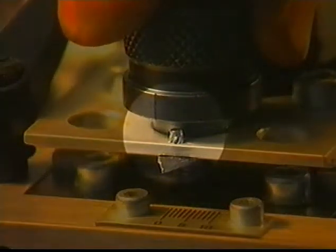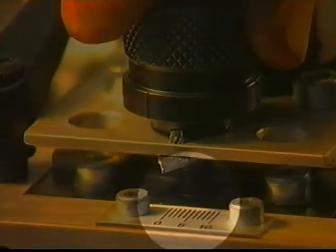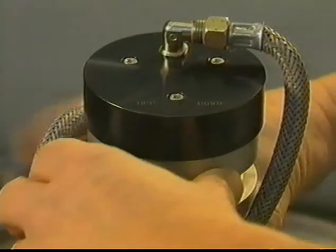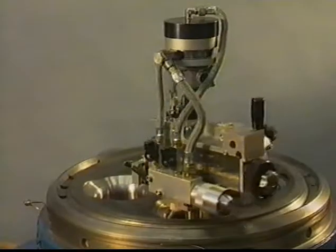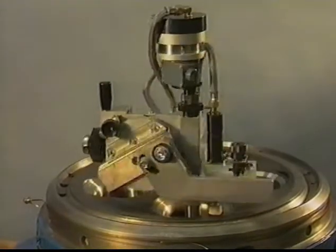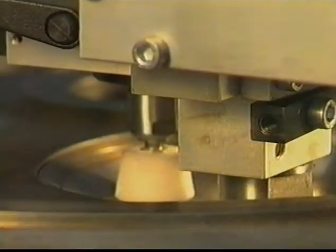One notch on the fine adjustment knob will feed down the grinding stone 0.1 millimeters. Normally, the feeding of the stone is 0.2, 0.3 millimetres for fine grinding. On delivery, the grinding angle is set for the relevant engine type, so it is not necessary to readjust. If several times are required to grind the valve seat, feed down a further grinding depth on the fine adjustment knob. Move the sleeve to the down position and start the rotary-driven engine.